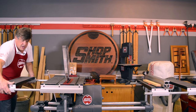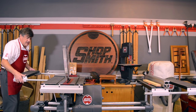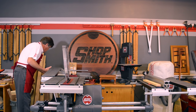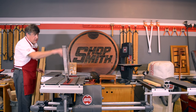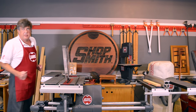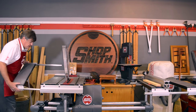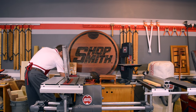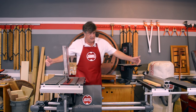The ShopSmith table saw's tables expand out to eight and a half feet, so we have plenty of support surface for those longer pieces of wood. These extension tables can be used as infeed and outfeed tables also. We simply stick it in here, put the telescopic leg on — now you've got infeed support. We can go six and a half front to back, eight and a half across. And when you're done with those bigger pieces, store the tables out of the way and the whole ShopSmith just takes two by six feet.